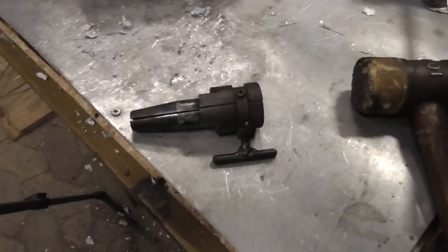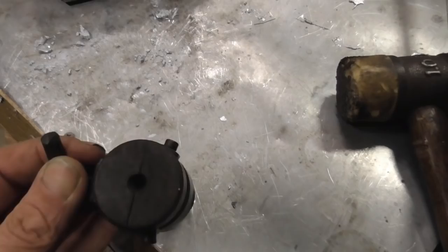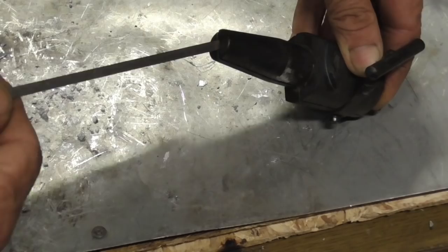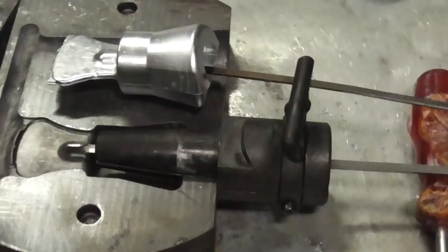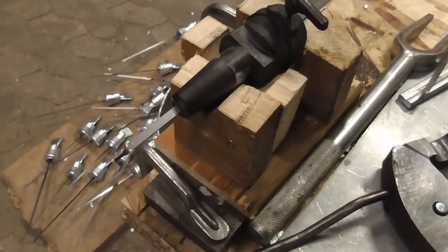Here is the core that also holds the stick itself — it is made out of two halves which can be clamped together. Here I show you how I insert the stick and finally how the core fits into the mold. You see that the stick is twisted at the end so it stays put in the final part. That big blob at the right end works as a riser. A simple wooden jig keeps my gloves from getting too hot and acts as a stop to adjust the stick position.